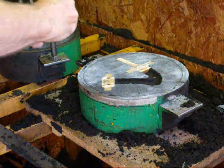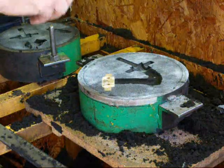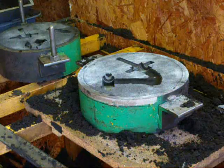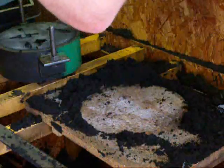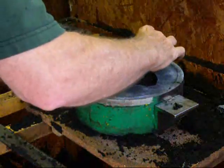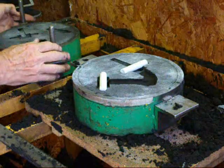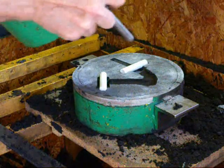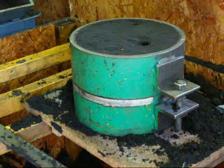We'll draw the patterns out of there. I've already got some little holes drilled for my screw — these lift right out. I've used these often enough; I know there are no bad spots. So those are out. Deepen this ever so slightly. Don't forget to set your sand cores in there — you're going to set them into the core prints and hold them in place. We're now ready to reassemble. Blow everything off, match your colors, close the mold. Colors are matched — now this is ready to pour. I will pour this in an upcoming video.